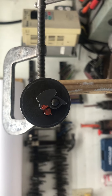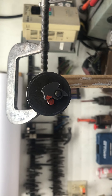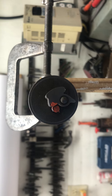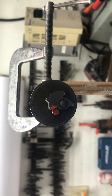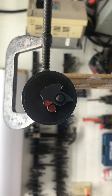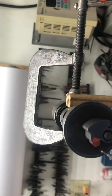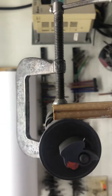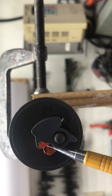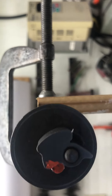First, take the cover off the side of your cam — it's on the left side by your knee on the Polaris 500. There are three screws; take them out and you'll see the end of the cam. It's best to position it exactly as shown here, with this quarter-inch dowel pin in the nine o'clock position.